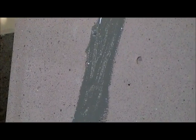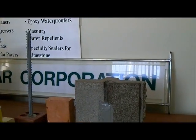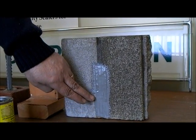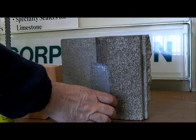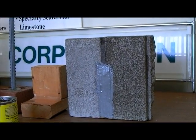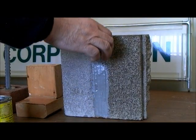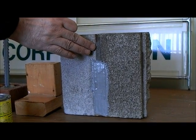For other uses of the epoxy waterproofer on larger cracks, you can apply hydraulic cement into the crack first, and then apply the epoxy waterproofer over the hydraulic cement and overlap. Sometimes hydraulic cement doesn't hold very well against hydrostatic pressure, but the epoxy ensures that no moisture is going to travel. The hydraulic cement is really working as a filler here.